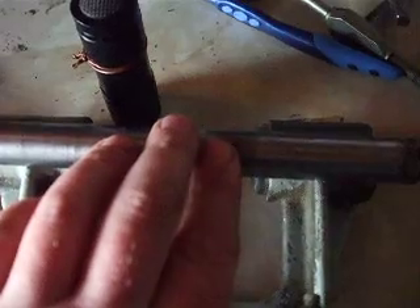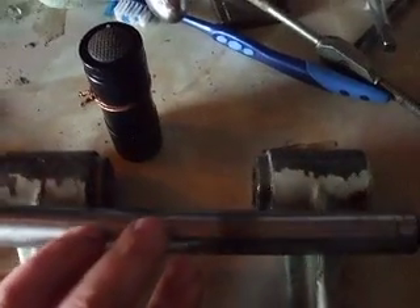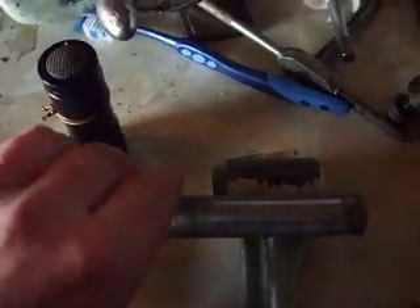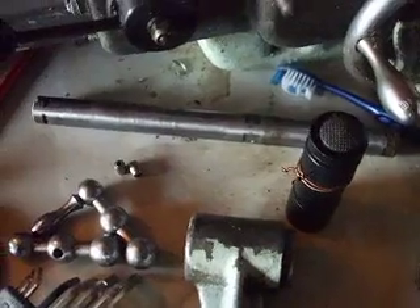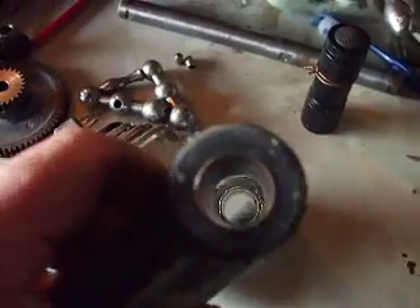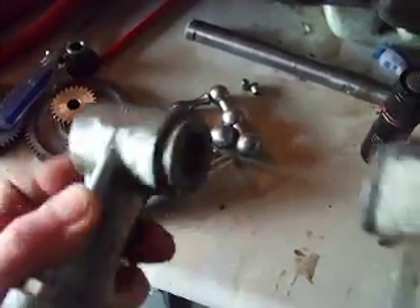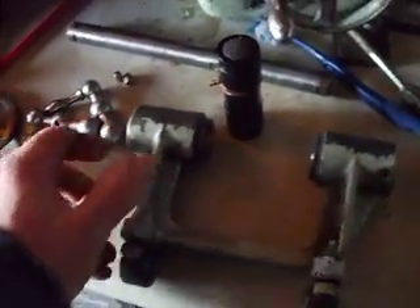There being three pulleys in total, and that was incorrect. It was actually on the innermost pulley with the smallest diameter. So, having realized that this is possibly a homemade part, or maybe a slightly older or newer model than the one described in the manual, I've had another look at the bearings. These are the bearings for the shaft to locate in, and to my mind that's a little bit narrow. I think somebody has put a bigger shaft in there and machined it out, for whatever reason.